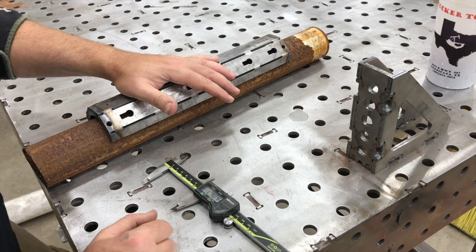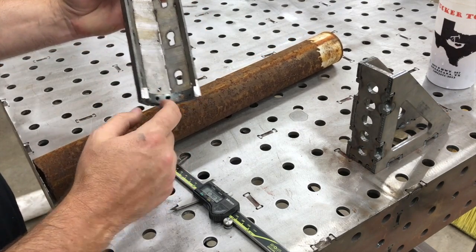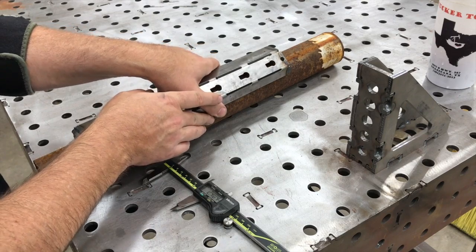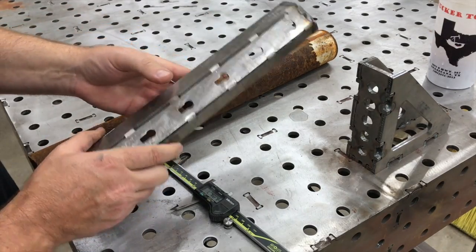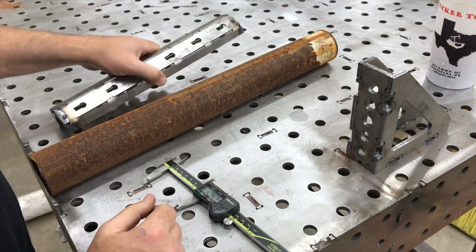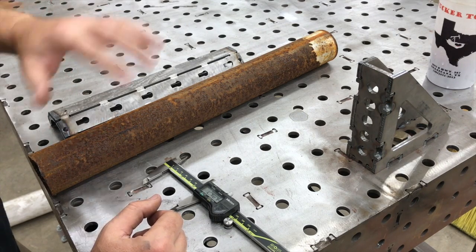I can use this going forward as a jig for the end caps that get welded in — pop the end caps on, get them square, slide the cover piece out over it after I get it bent, put it down, clamp it to the table, and get some tacks on it. That way I know it's going to be consistent. If Matthew is able to sell a bunch of these things, it's going to be an opportunity for small production runs, so having a decent jig setup to make it go smoother will help keep costs down and productivity up.